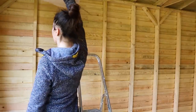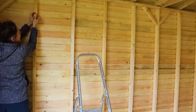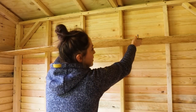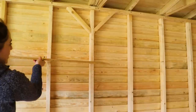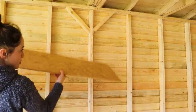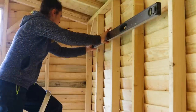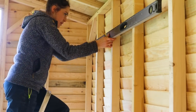I'm going to go about here so they will start with this first line. That's lucky — I can get that across a few spars and I don't have to chop it down. By the time that's there I'm going to have this spare, so you could hang some garden tools or overlap it with a piece. After creating my initial mark, I line up a spirit level and adjust until that bubble is dead center before drawing the line on the rest of the spars.